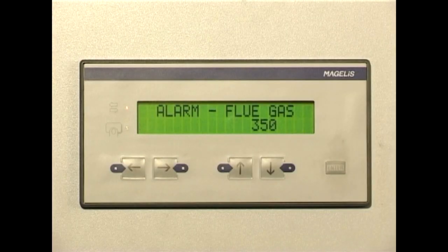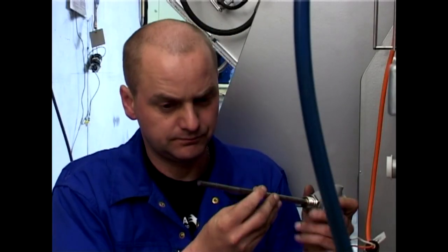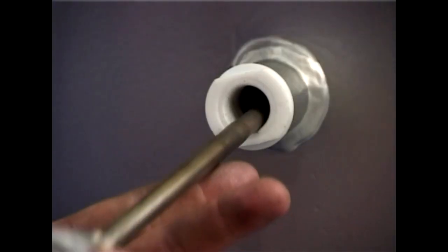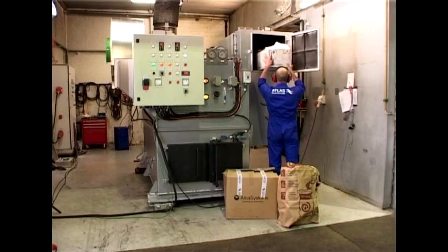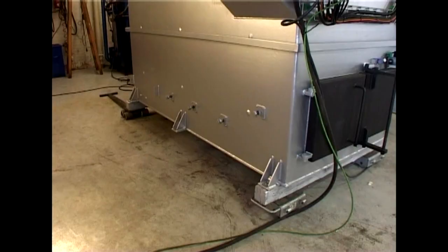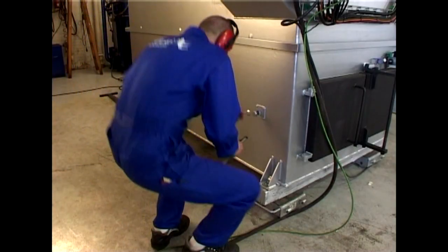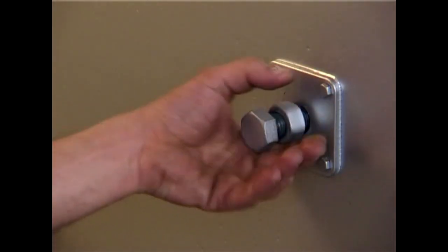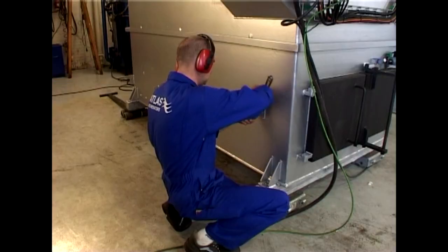A funnel temperature alarm comes when the temperature in the funnel system is higher than expected. A frequent reason for this alarm is that the thermocouple in the funnel is faulty. To fix this, find and replace the faulty thermocouple. Another reason can be that the calorific value of the waste is too high — the way to solve this is by reducing the loading of waste into the incinerator. Finally, a different approach is to add more cooling air to the flue gases by opening the air nozzles in the secondary chamber.